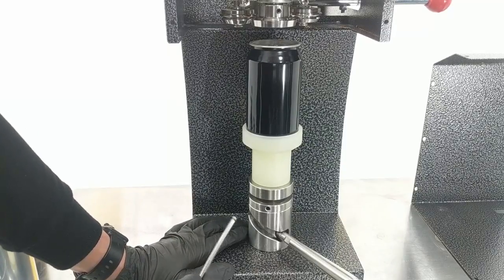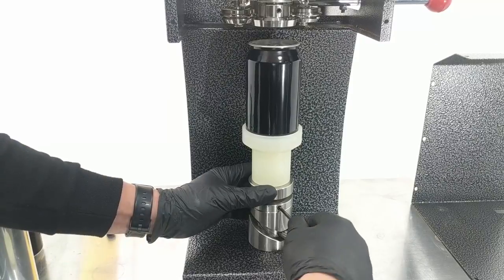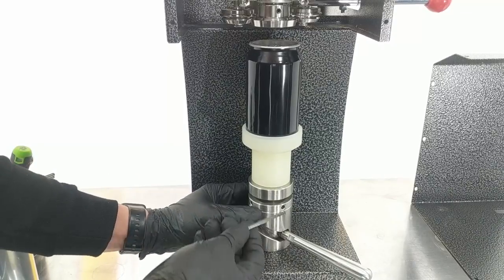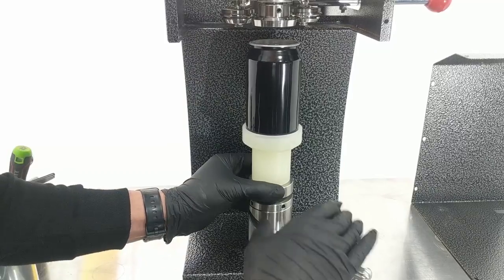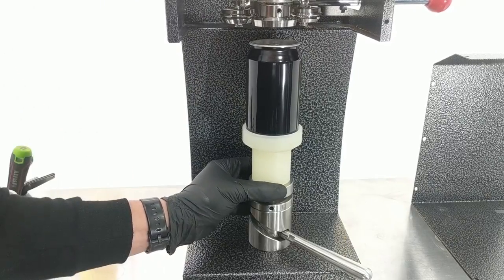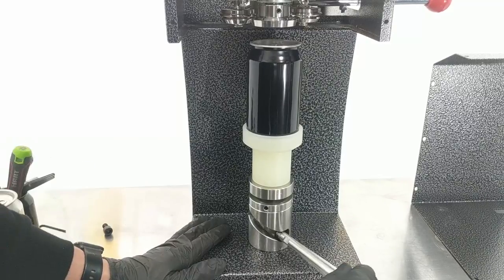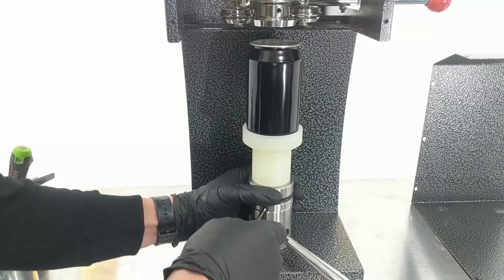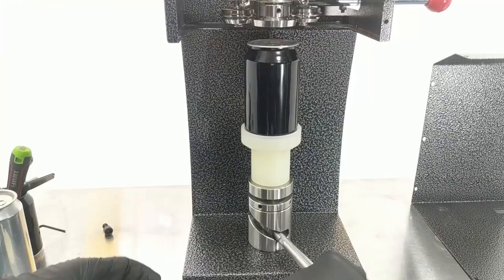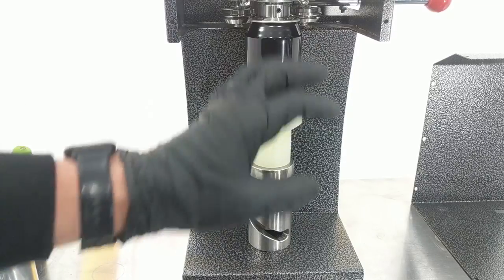For aligning the table you've got a couple of options. First, fine adjustment using the coupling nut: undo the coupling nut, then with one hand move the table left, right, backward, or forward depending on which way you need it, while using the other hand to tighten up the coupling nut at the bottom — hold both pieces together. Now it's basically spot on — perfectly concentric so the lid on the chuck is just grabbed concentrically.